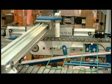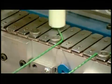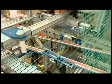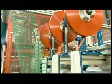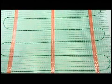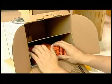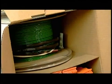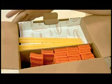Another machine assembles the roll-out mat format, with heating cable embedded. First, it winds cable the same way an installer would onto installation gauges, then secures it to an adhesive-backed fiberglass mesh. Three strips of adhesive tape above and below reinforce the bond. The mat format is sold by the roll, while the loose cable is packaged in a kit, with installation gauges and glue sticks to adhere the gauges to the subfloor.